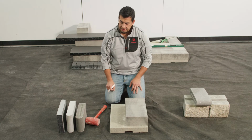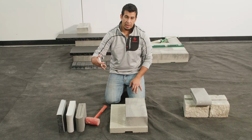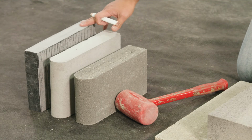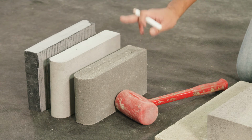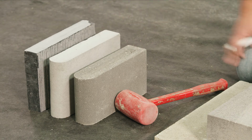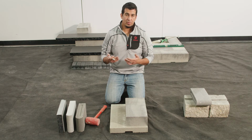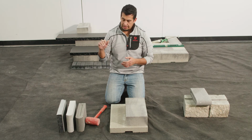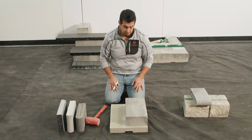The other thing that needs to be considered is your coping piece. That would be the tread on the step. What you'll see here is between our natural stone at 5 centimeters, our ledge stone at 6 centimeters, and then our Brussels fino here at 7 centimeters, we have quite the range in height. That coping is pretty much going to dictate your starting point on those steps. So knowing exactly what's going to be used so that you can get the right heights for your rise and your run is crucial to the start of your build.